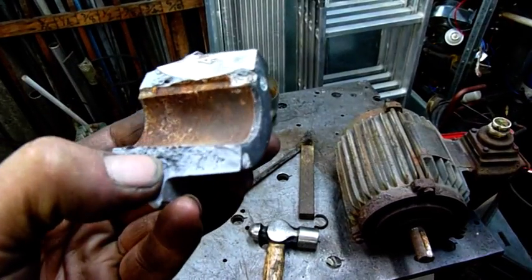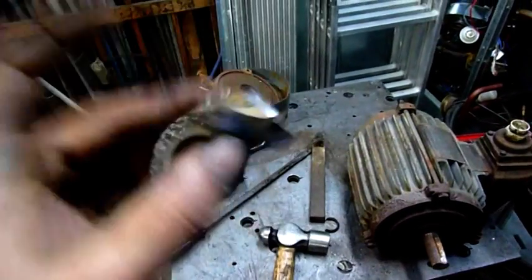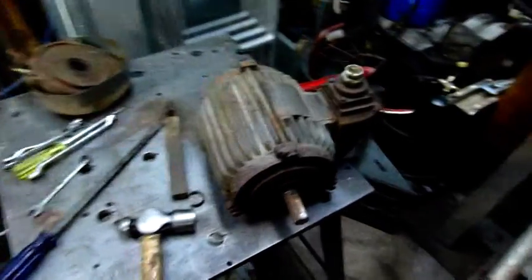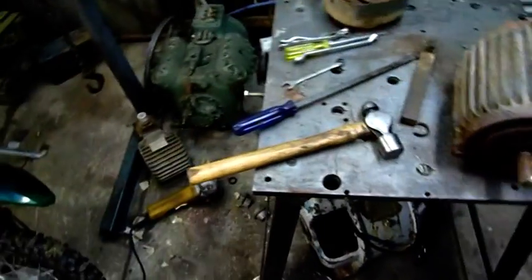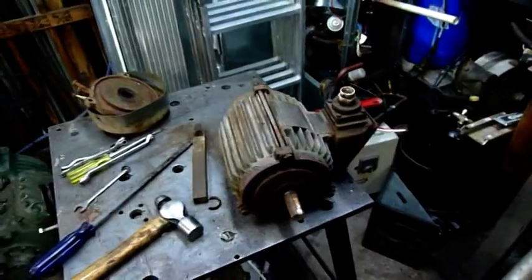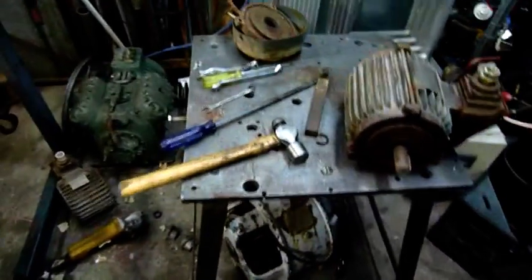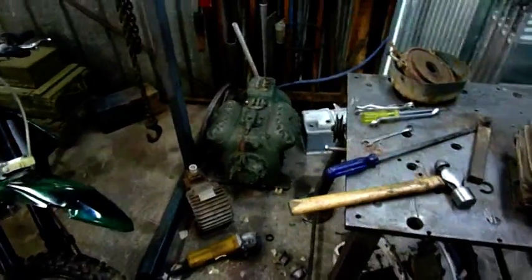Look at the holes and pitting in this stuff — dross, porosity. Very cheap nasty pressure die-cast aluminium. You can use whatever scrap aluminium you want and it works in high-pressure injection die casting. That's how they get rid of all the low-grade aluminium — you can't cast that stuff with gravity die casting, it goes porous. I spent four years in a foundry and you learn all about what casts and what doesn't — at least as far as gravity casting goes.